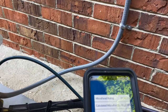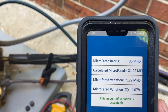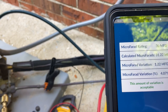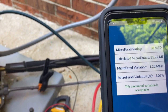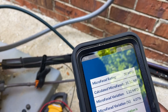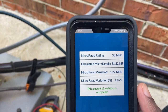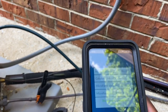As long as you're not plus or minus 6%, the app says the variation is acceptable, so you basically know your capacitor is doing all right. It also has other messages — 'slightly out of spec' means it's on its way out, and 'bad' means it's basically gone but just hasn't fully failed yet. That's how I test capacitors on the load using the HVAC School app.